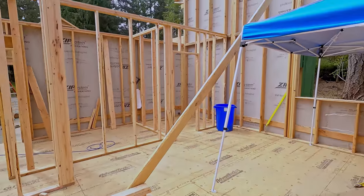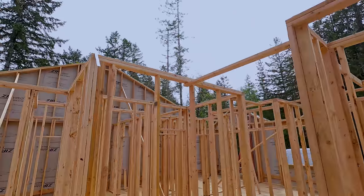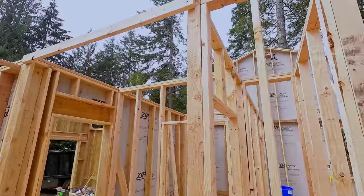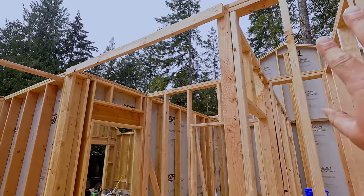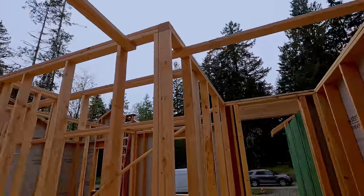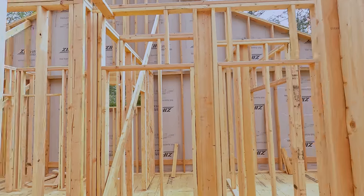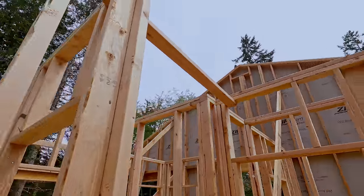So yep, that guy's in the way because it's a big wall. But then what we do is we connect as much across the top as we can to walls that are connected to sheathed walls. So as an example, this wall is connected to a wall that is not going to budge. Then we just push it plumb, tack it. Same thing above me. So the only spring brace we needed was here, because that front door wall was just pretty jacked. Those two braces have stayed in place, but almost everything else is above.